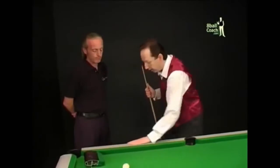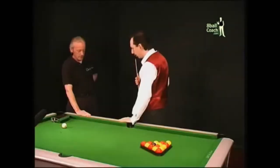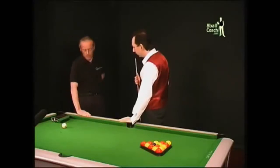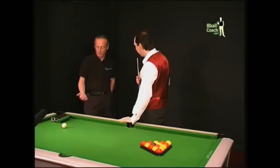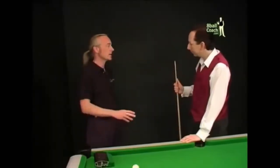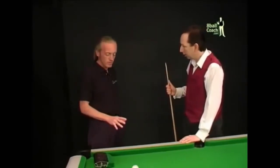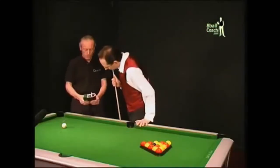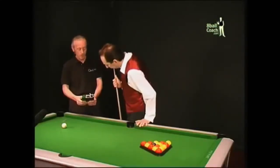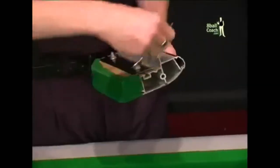So all this surround here, that's got metal inside? That is aluminium covered in a formica fascia for decoration. Right. So even when that's clamped to the cabinet, the clamps engage with the top frame itself and not with a plate that's been riveted on or screwed on afterwards. Again, reducing any chance of movement. Just to give you an example, this is a cutaway of the section. You can see it's very light, but it's also very strong. The beauty of that is that it can engage directly with the cushions.